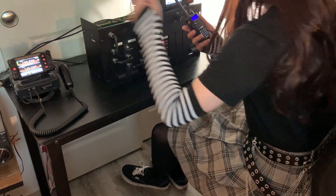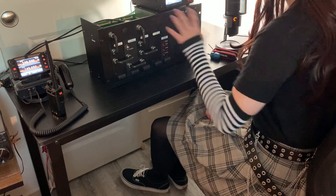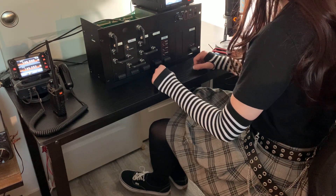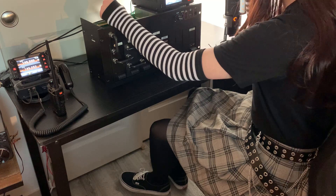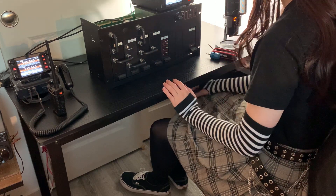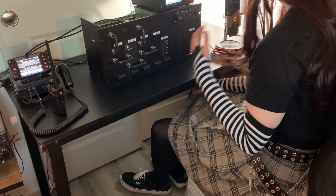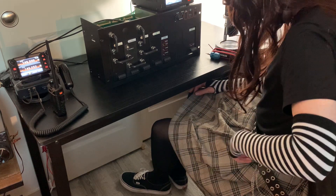Test, test. I ID'd within the past 10 minutes so don't worry — the repeater does the ID anyway. So there we go: that's the GE MASTR III — really simple, really effective, and a relatively quality product. The backplane in there has options for more expansion if you want to design stuff; the cartridge connector up top is what you want. The PA sits on the back. If you decide to use a custom PA you need a lot of gain — as I said, about 50 dB — so you may need to run an amplifier into an amplifier, but it's not the hardest thing in the world.